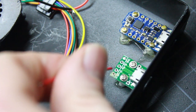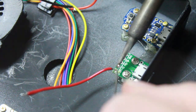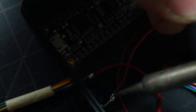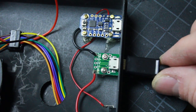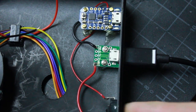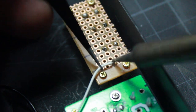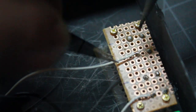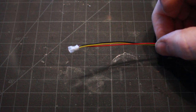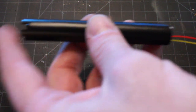It's time to start soldering up my wires. I'm going to start by running power to my trinket board and to my soundboard — running hot, ground, and getting everything set up. Now that I've run the power I'll do a quick test and plug it in to check my switch. I can see the trinket turning on and off with the power switch. I'll continue running lines for my switches, activating the laser LEDs, and activating sound effects on my soundboard. Here is my wire harness for the laser LEDs — it fits through the tube, comes up through the bottom, out the top, and plugs into the bottom of my X-Wing.